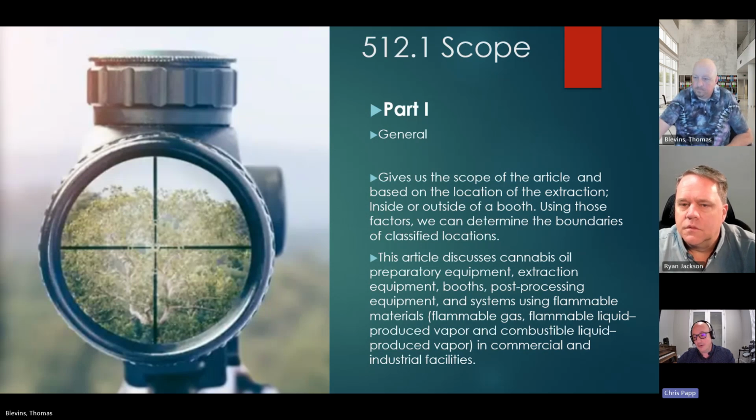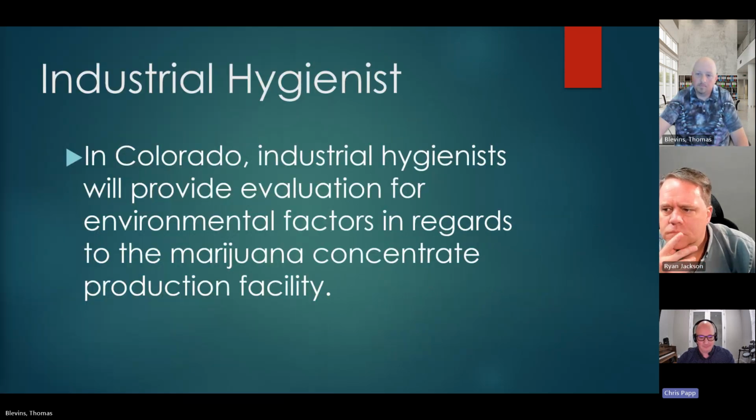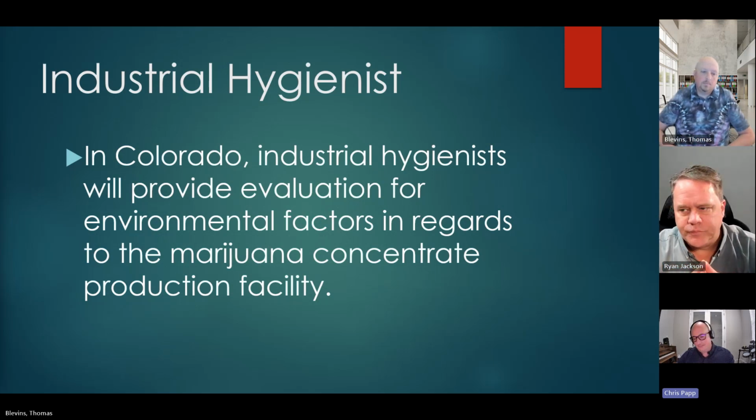And then the other thing I like to bring up here before we pull up the next slide, like we talked about, is we know areas around equipment, around the booths are easily delineated. And in Colorado, as far as section 500.4 and area classification drawings, it kind of leaves it in the air, right? And even in Chapter 4 now of the proposed NFPA 420 text, if you're in the view looking at right now, public inputs are open, so you can see the draft. They do need hazard analysis, but again, it just leaves it to qualified persons. And then the definition leaves you kind of guessing.